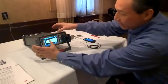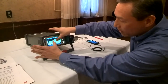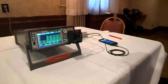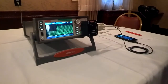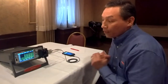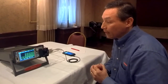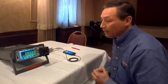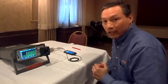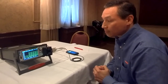So now you want to go in and look at that waveform and see exactly what happened — you can pinch and zoom into that area and see your data. It has both edge triggers and pulse trigger windows, so it has a very deep set of triggering capabilities to capture waveforms and transient events that customers want to capture.